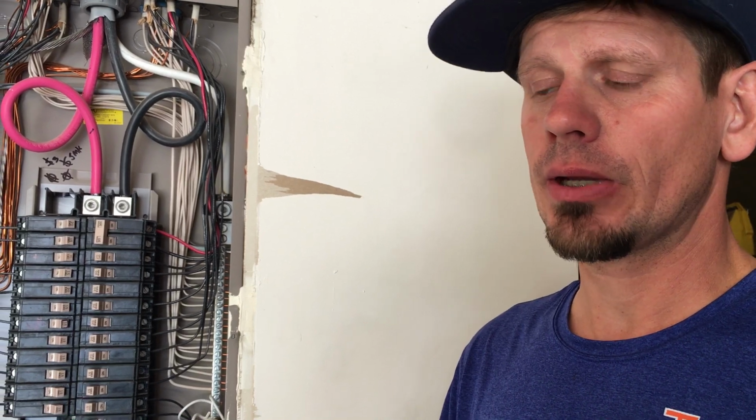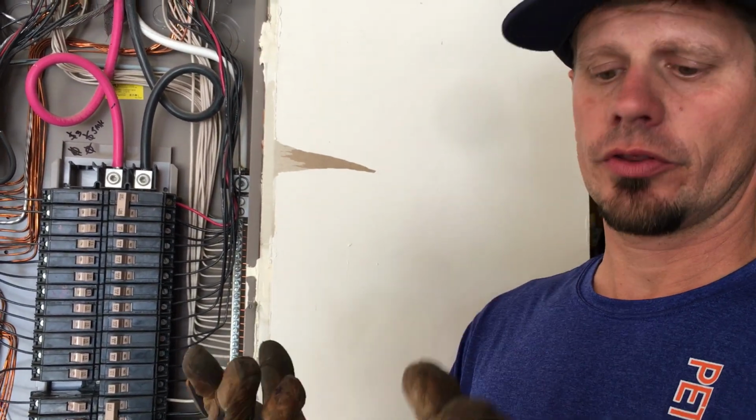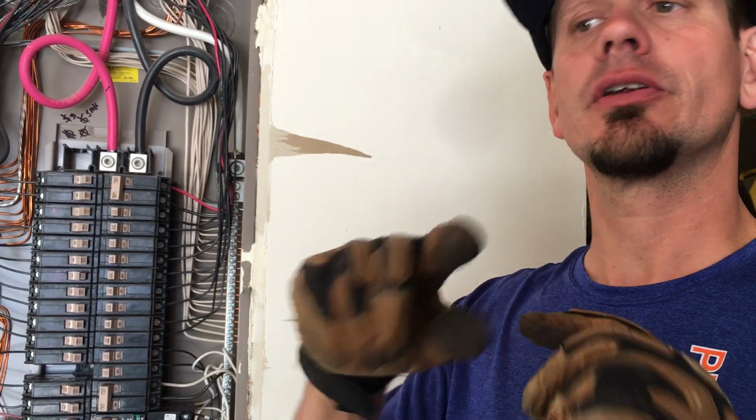We had about 2 the other day and 4 today. Now we got to go through and put it all back in the wall, put in TR plugs, make sure that as we put in our TR plugs that nothing's tripping. I do suggest you turn it off. I typically try to do some things hot with my gloves just to put the plugs back in, to make sure, did I touch anything as I put it in, or did something flicker, using my light bulbs.